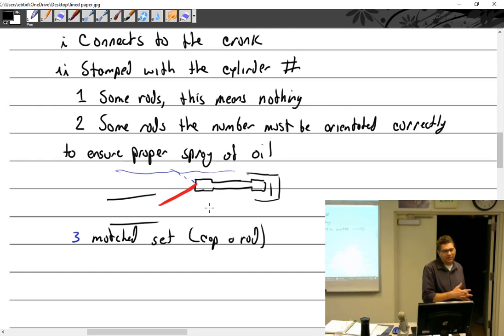When you lose a rod in service, that means you're going to lose at least one cylinder, and you're going to have something flying around inside that engine making noise and doing damage. So you had to do this critical inspection, which still stands — do the inspection. If you have any fretting, you have to have them reworked. You send them out to somebody who can do this specialized work, and they shave off a little bit where the cap and rod go together, then bore it out to the right size. That is quite a job. That's the large end.